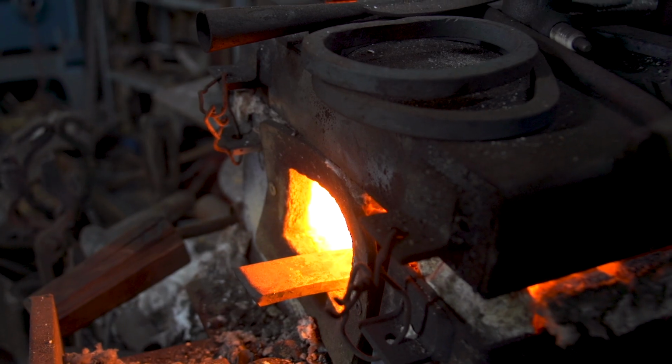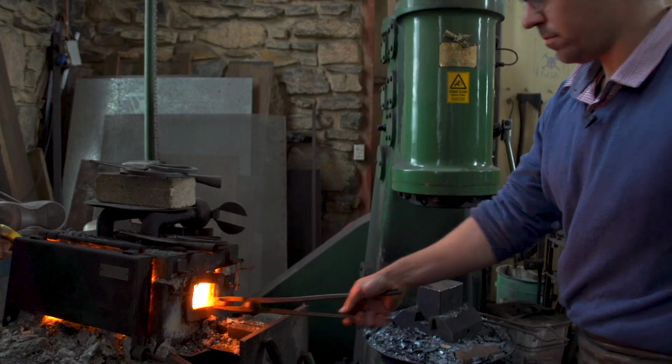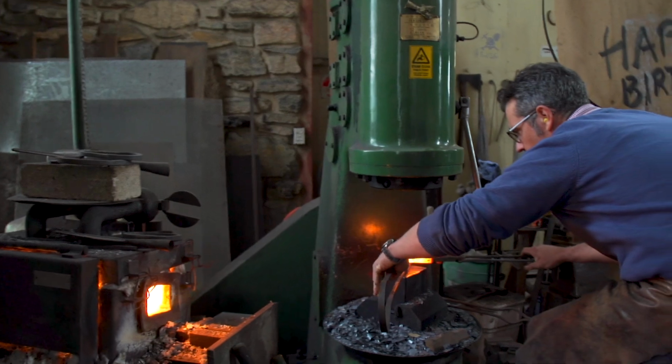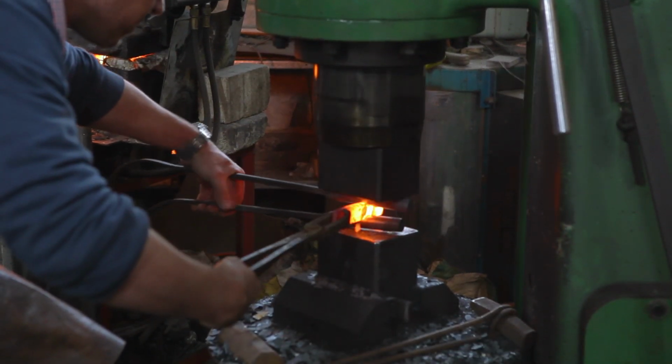Okay, the steps to make a chisel. Firstly, you need to select material. It's normally, let's say, roughly rectangular, maybe might be round even. Neck in with some fullers, top and bottom fullers. For me, it's under the power hammer.